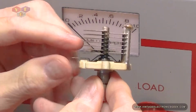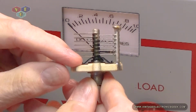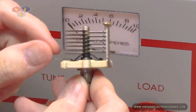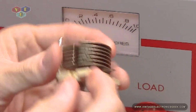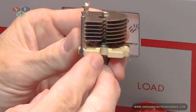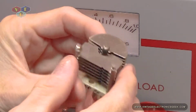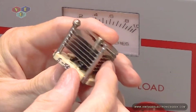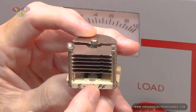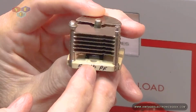You see down here at the base where it's got the piece of metal going over the shaft, the very last one. Take a screwdriver and you could bend those up, and by doing that, then you can spin these around and land them into the next notch. And you see those two little bumps right there? That's where the tab needs to fall, in between there. And should have some corresponding bumps on the other side. Little tabs, which you can see right here, where that is falling in line.